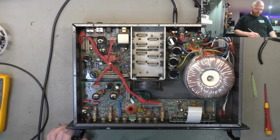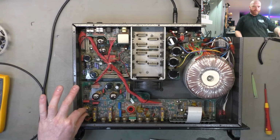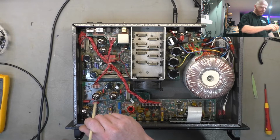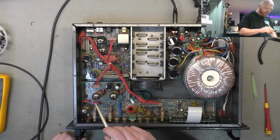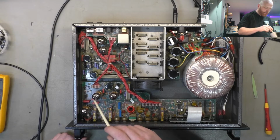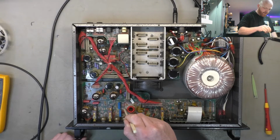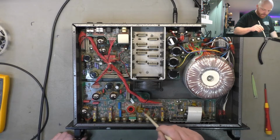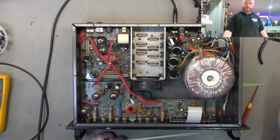Alright, so with the output and gain turned up all the way, things are very microphonic, and it picks up hum when you put your hand near the valves. Of course that'd be microphonic just because it's cranked and the input's not grounded. There's no intermittency or massive shifts in noise level. That board's probably fine, but I'll probably pull it out and check the bottom side anyway.